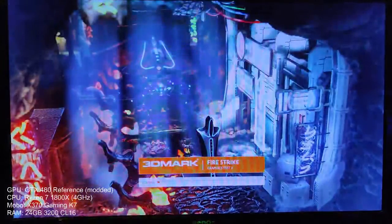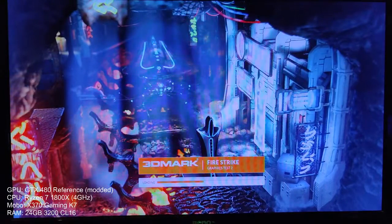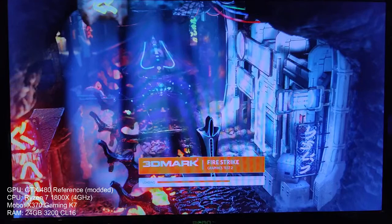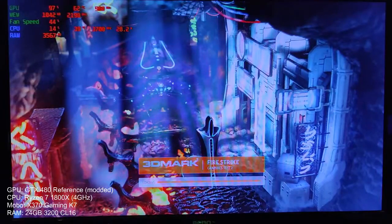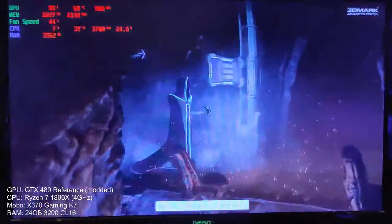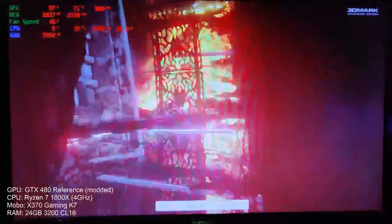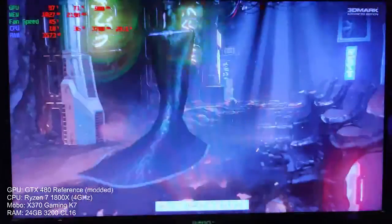So yeah, turns out my 2080 Ti just has a bad core, but it has really good memory. Like, you max the slider, it's plus 1500. And sadly the overclocking on the core does not improve if I remove the memory offset. It's just not that great of a core. 2085 megahertz was the best I could get out of that card. By now I found a tweak to lock in a higher power state with a higher voltage, which apparently 2080 Ti's do scale with voltage a bit, because now my card does 2145 instead of 2085.